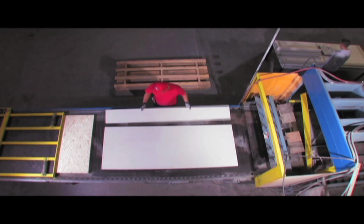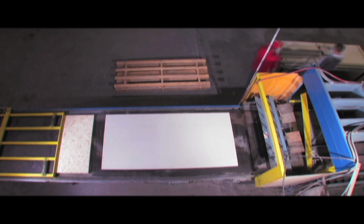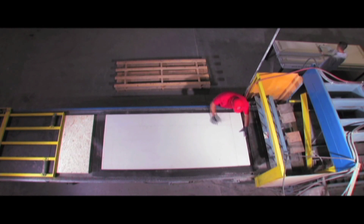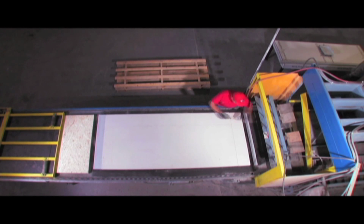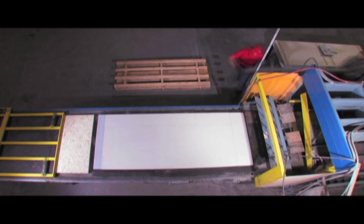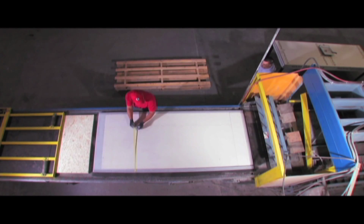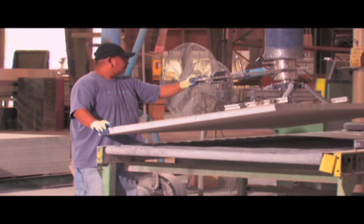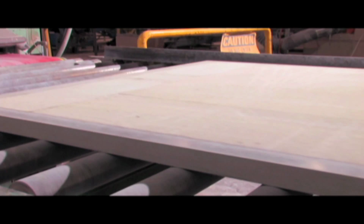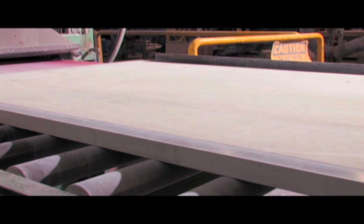project. For many of our customers, the process of assembling a door leaf using Warm Springs Composite products' door core, stiles, and rails is different than the process they're accustomed to using. In this video segment, we will explain the process step by step. Our core material can be glued together using a PVAC adhesive to build a door leaf of virtually any size and still retain the required fire rating.